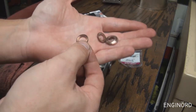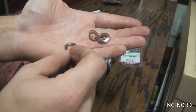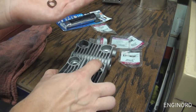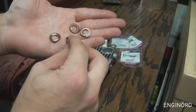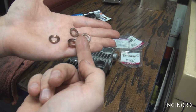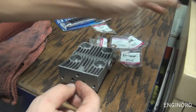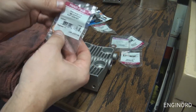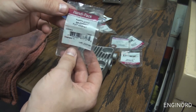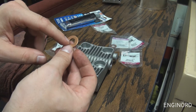Next item are the washers. In these cavities there are copper washers. These are the original copper washers, and you can see that from the tightening torque they are dished. I'm not sure, but they might have been oversized for this counterbore. You can see they are completely dished — the edges are curled up — so I'm going to toss these.